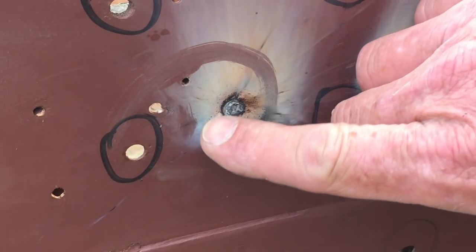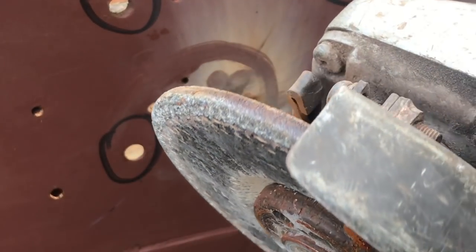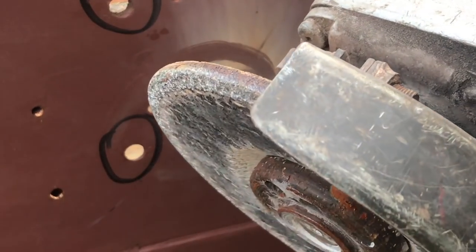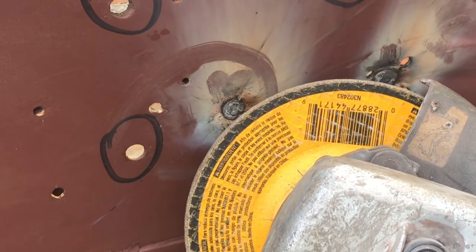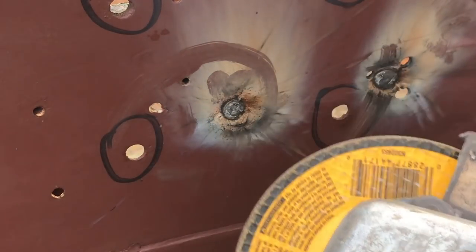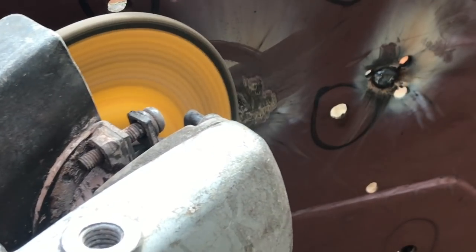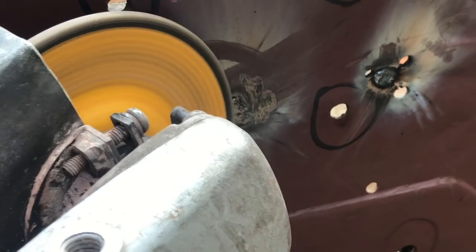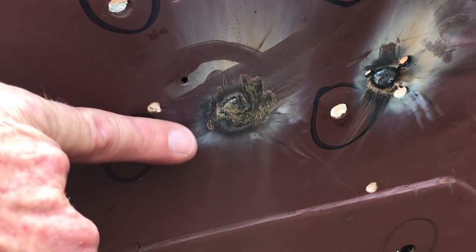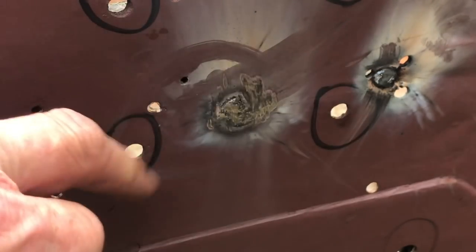We've got our hole welded here and it's still raised up. It's cooled down now, so I'm going to take my side grinder — that's just a Dewalt grinding pad you can buy at any hardware store — and do what I'll call the rough grind: grind off that weld and try to get it smooth. After I get it close to smooth I'll go back with my soft pad. Then I'm going to change out to this 80-grit soft pad and finish that up.